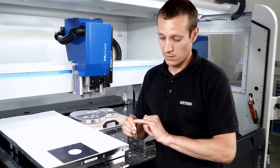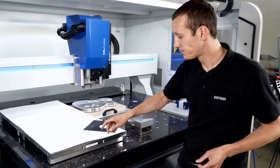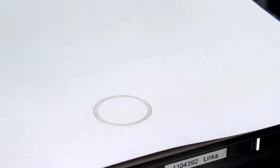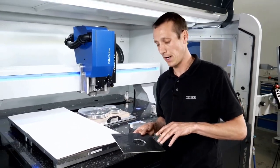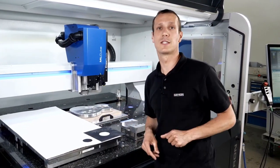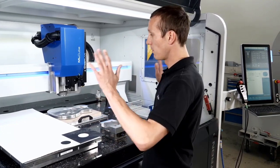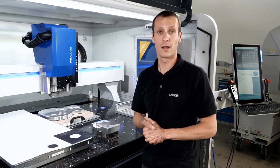We can see a sharp edge with no burr on the part. Looking closely at the vacuum cart, we can see the contour that we milled through in the paper. We usually go about 0.2 to 0.4 millimeters deeper into the vacuum cart to make sure the part is completely cut out and we get a nice sharp edge. Because of the remaining cardboard, the vacuum force stays quite high. Vacuum is actually the perfect work holding solution for plate materials — you can batch parts by placing a large sheet and cutting multiple parts with a single press of the start button.